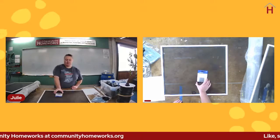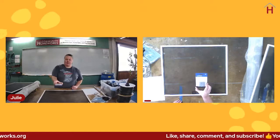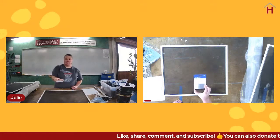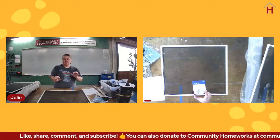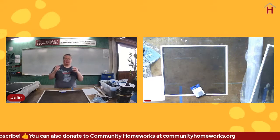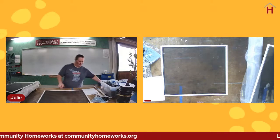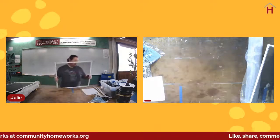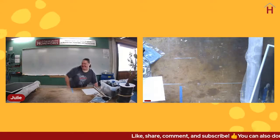If you do have metal screen in your window screen, you would use this aluminum patch. And this is actually a little piece of aluminum. It's a little square. And you would put that over the patch or the whole area, and then you just bend these little metal tines in so that it grabs the original screen. So screen patching is also a solution.